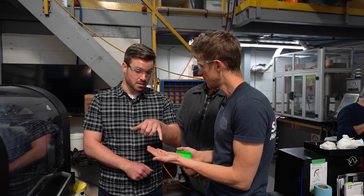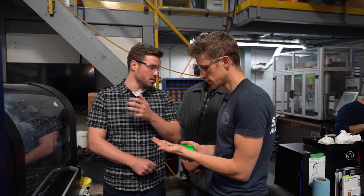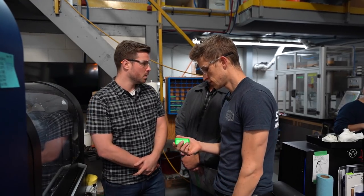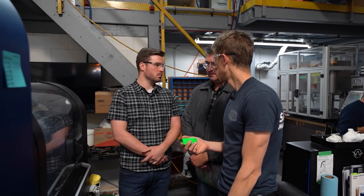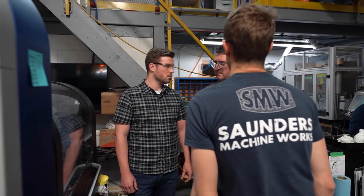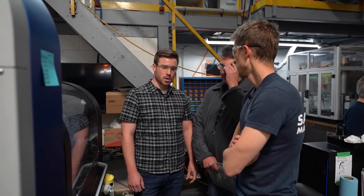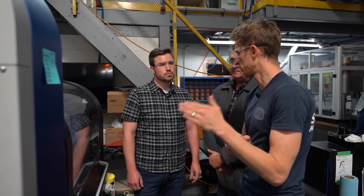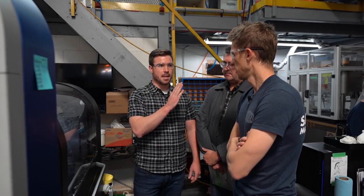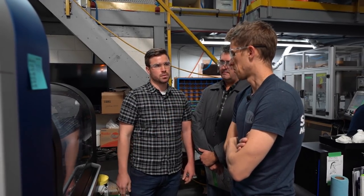And would the finish change look good on your part? Not quite as nice as that. Right. But as long as it's not a coarse finish, I think we could get away with it. So we're probably looking at around a 20 to 25 second cycle time per part. And if you're buying 100,000 of them a year, you'd probably have, I'd say, two shifts of capacity left at least. And there's nothing fancy on it, right? It's just turned, cut off, done, right? Yep. It's a small nose, a body, and then a head and a part.